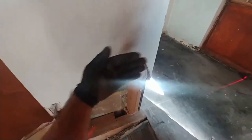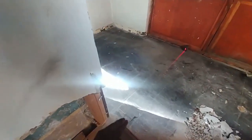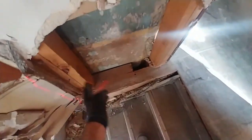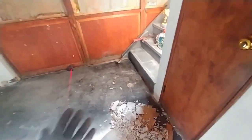I think what we're going to do here is this short wall that comes out. I'd like the surface of it to have drywall that goes right down in behind the stair stringer, so the framing is going to move over a lot further than I had planned until I opened up this wall. So the plane of this wall is going to go right across here and then stop, turn, and go over, which will mean that we'll add to the face of this framing to get it out to the face of this beam here, and we'll start our new wall there and go across, and we're going to do what we can to keep it square here, but who knows what's square?